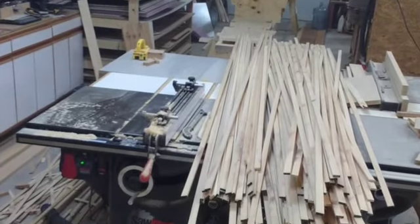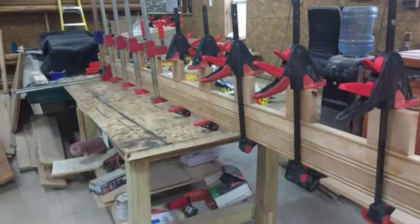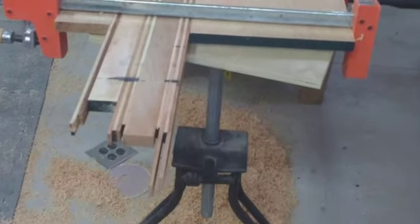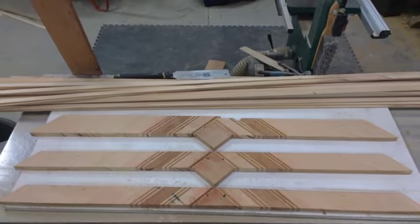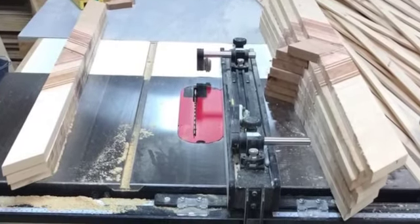For the decorative area I took some varying widths of boards of cherry and just made a design, gluing that up. This took quite a bit of time, but then I cut a 45-degree angle on the boards, cut those into strips, and glued the separate strips together with a central little square piece of cherry.